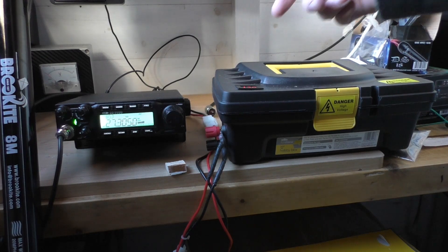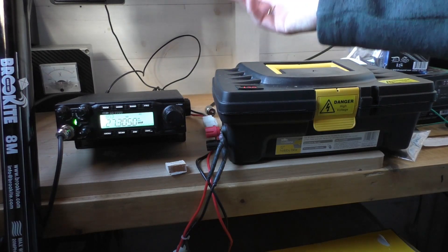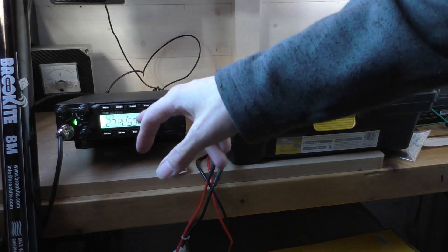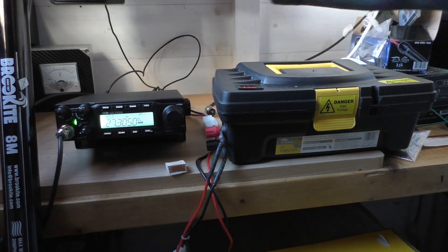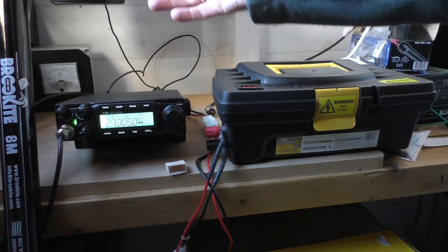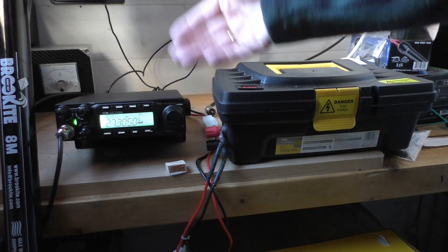I'm going to message Dave, Tango Mike or CharlieTango 061 — Dave's going to come on also using his 9900, so it's going to be 9900 to 9900. The antenna is only about a metre off the deck. It wouldn't be much use on FM where you need line of sight, but on sideband you can get away with a low antenna as long as your noise level's low — and it's about 2 to 3, maybe 4 today. I'm south St Albans, Dave is north St Albans. There's a lot of infrastructure in between — the whole town, high-rise buildings, a big hill. Dave normally gives me about an S7 to 8 signal, so it'll be interesting to see what I give him.